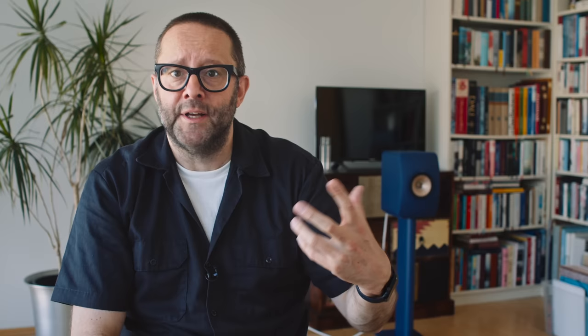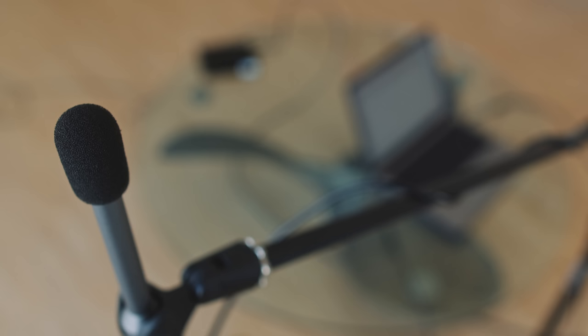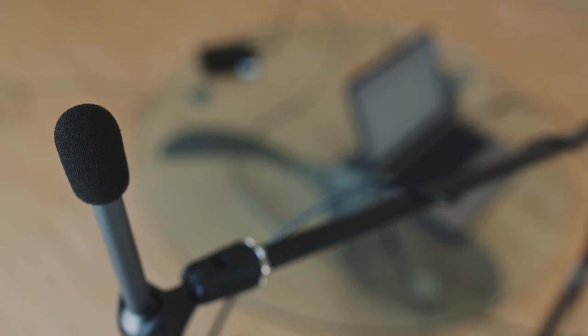You can probably hear that this room has a lot of reverb going on — it does not sound good at all. You can hear the zing at the tail end of that sound. That's the room's high-frequency reverb. Just like with my room, we can measure that reverb using Room EQ Wizard. So I brought with me a pair of KEF LS50 Meta. I've got a Bluesound PowerNode as the amplifier, and I've hooked up my Room EQ Wizard measurement system. Bridging the gap between my laptop and the PowerNode is a Topping D10s, which converts USB to Toslink. I connect the microphone to the laptop as well, and then we generate a frequency sweep, heard by the microphone and analyzed by Room EQ Wizard to give us an RT60 reading.